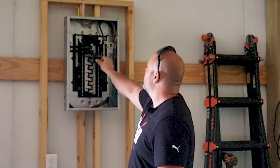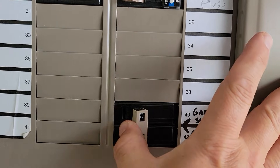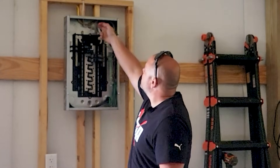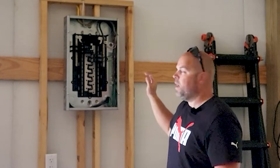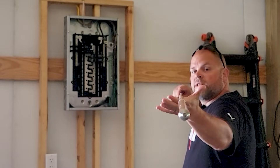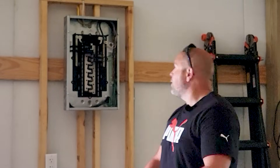I'm going to get it set up here, put you on time lapse. I'm going to rip this out and see if we can get everything fixed, show you what that looks like, and then wait for the next inspection. As always, the first thing you want to do is turn all your breakers off. Make sure that the main feed in the other garage over at the house is turned off as well, which I've already done. We're going to take these white and yellow Romex wires out, take off the ground wire out to the grounding rod outside, install the second rod outside about six feet away, and then we should be set for our next inspection.